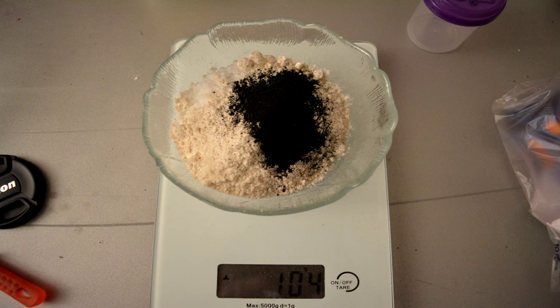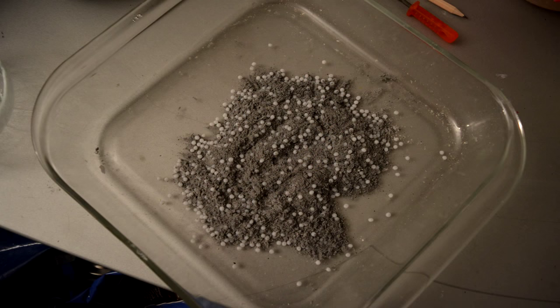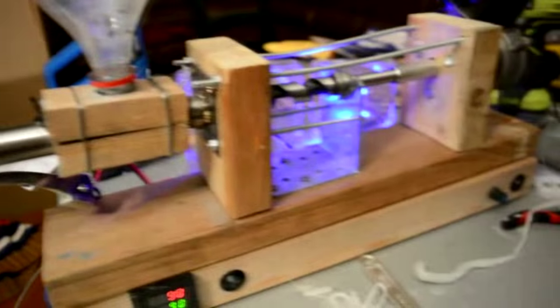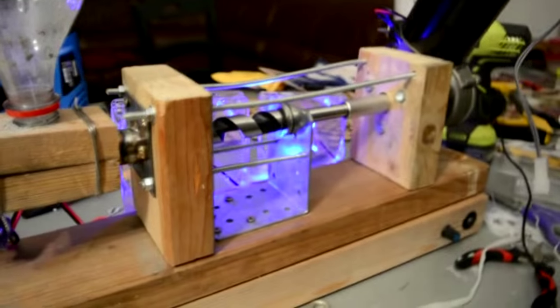Adding the pigment is simple enough. Just add 2-5% to the mix and knead it in along with the filler. Since I've built Bernie, I no longer have to worry about needing to knead, but just simply pour a little pigment down the hopper along with the rest of the stuff. Basic procedure 1A when making the material, and saves you a lot of time priming whatever it is you're building.